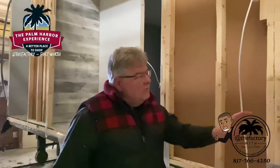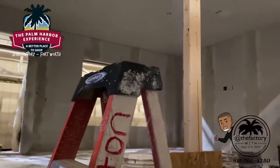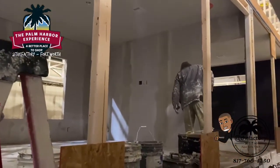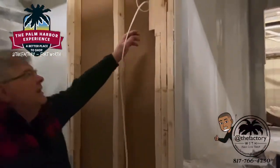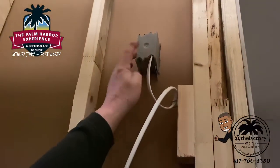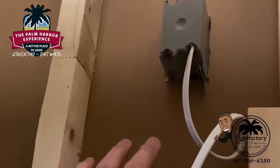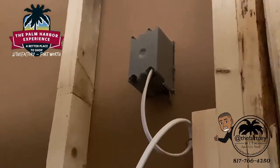During the production process, people are working on tops, sides, and inside all at the same time — highly efficient. Right here the drywall is going on, they're taping it; after a while it will dry out and they'll prep it for finishes. Meanwhile the wiring work continues — the electrician stands wire off the studs, and the electrical boxes set on half-inch gypsum with wings so receptacles and switches are placed where needed, not necessarily where there's a stud.